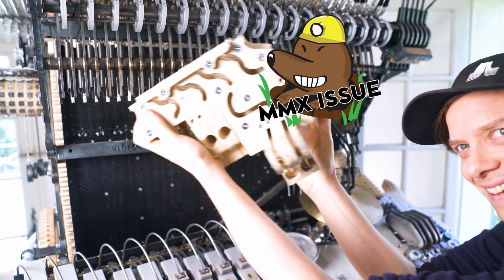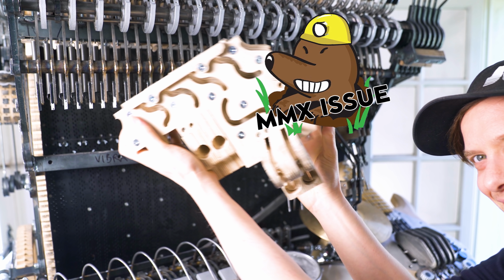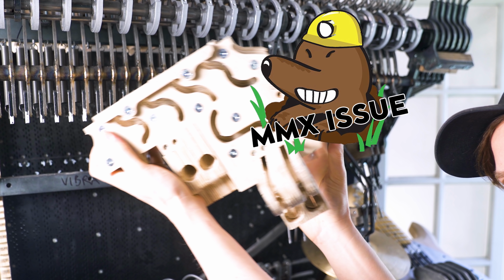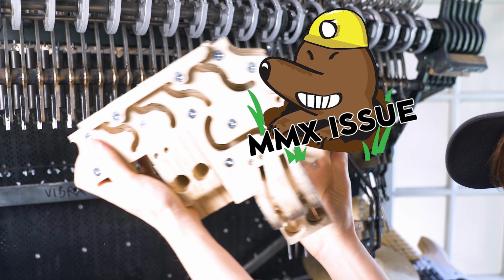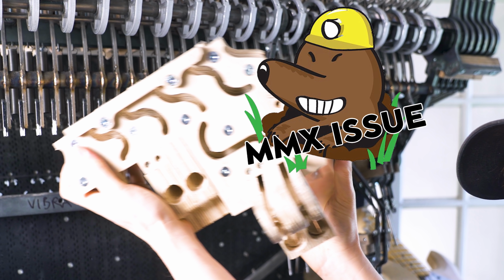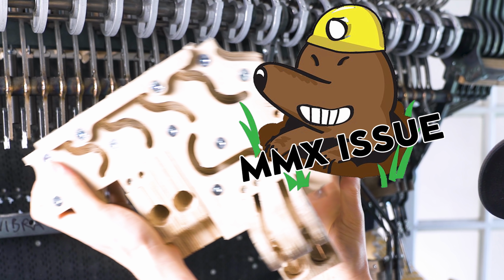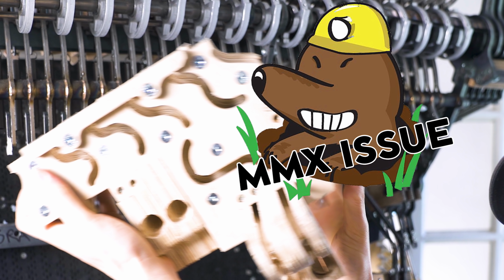And here's the big point with this video. I'm now able to remove this custom plywood labyrinth, which earlier took care of the marble pressure, but it had a custom design for each of the 38 channels, which I'm now replacing with a module that I can copy paste across the whole Marble Machine X. That is better design.